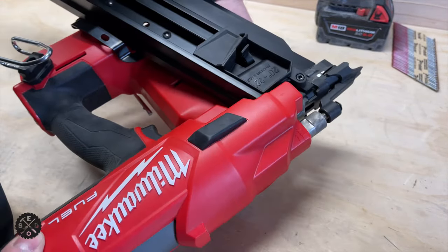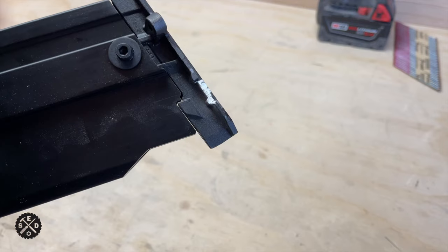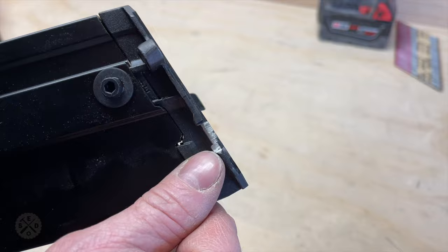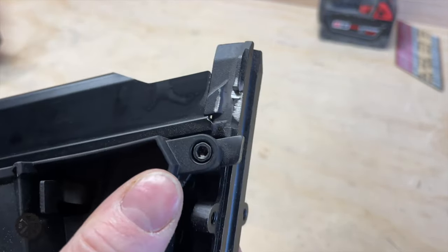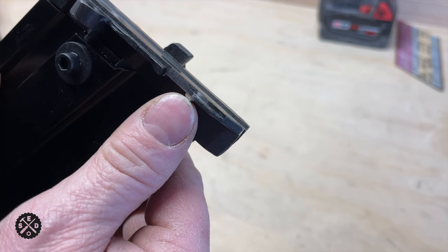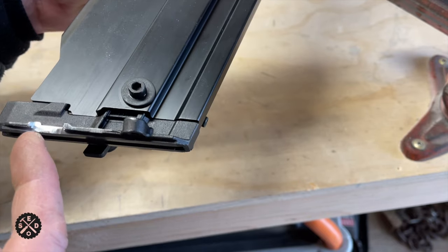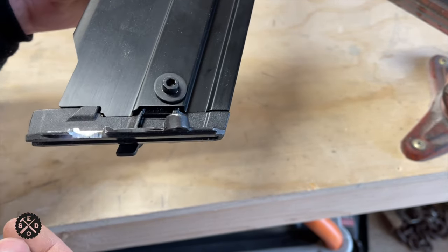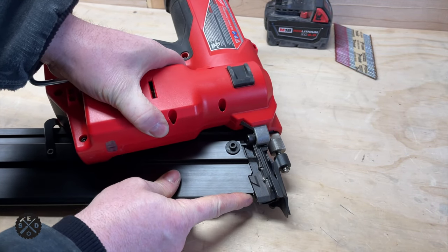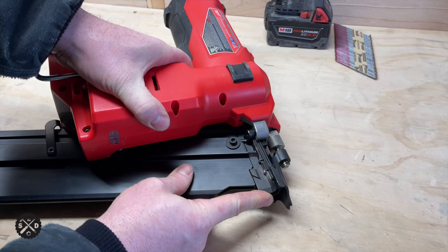That's part of the process — I wanted to show you this in real time so you know you just have to test it out. I'm going to finish disassembling this and grind a little more off that side. The backside before I do anything is about an eighth inch that I took off. This side's a little bit tapered, but right down in that groove where it matters, it's about an eighth inch on this side as well. It appears I need to take another sixteenth off of this side. With my little sander it is a little tricky to get in there, so I was trying to turn it sideways to get into that corner.